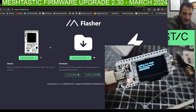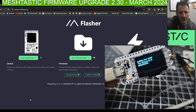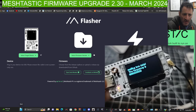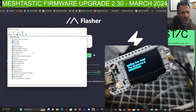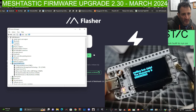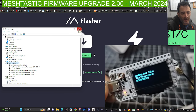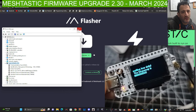So we've connected the USB-C. We'll go to Device Manager — the link's in the description. Right-click on the Windows start button. The cable is plugged in, and you're going to know if it's a good cable because when you expand COM ports, you're going to get this: Silicon Labs CP210x USB to UART Bridge. Mine's COM29 — your number will be different but the driver will be the same. If you've got a cable with no data, you won't get that, so just get a better cable.